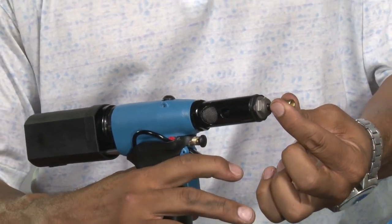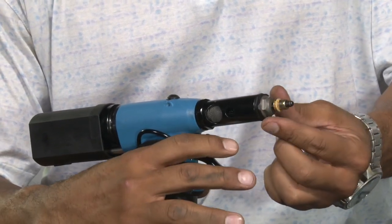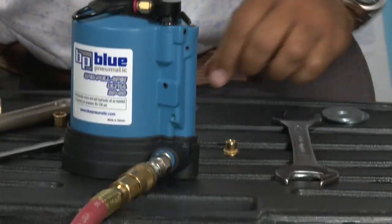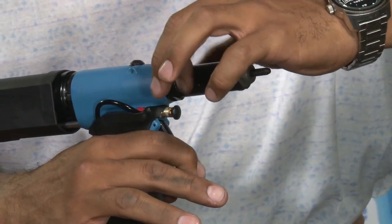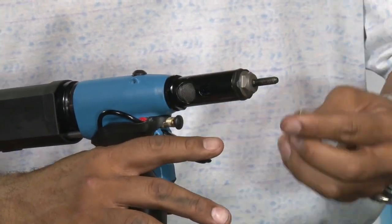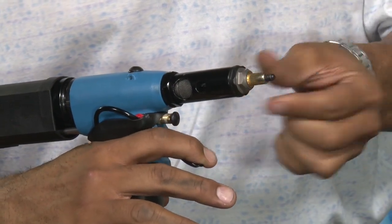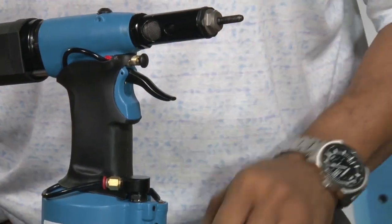We'll pull the trigger halfway, pull it down into the insert, and set it, release it, spin it off. That's pretty close. When we get that close, we want to pull it again, all the way down, turn it another full revolution, try it again, see if we're there. Spin it onto the tool, pull it, release it back out. Looks like we got a good set.